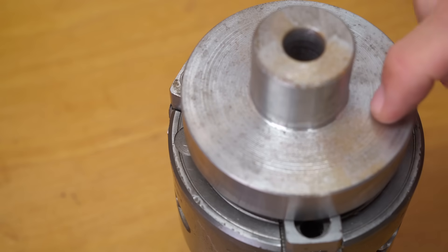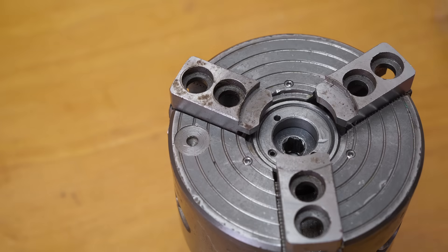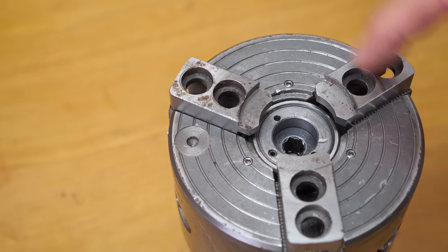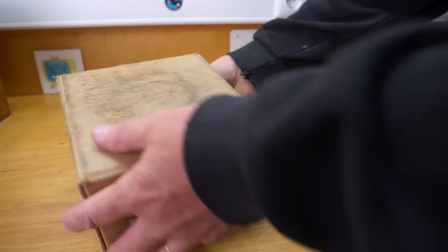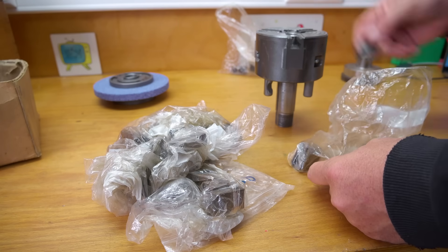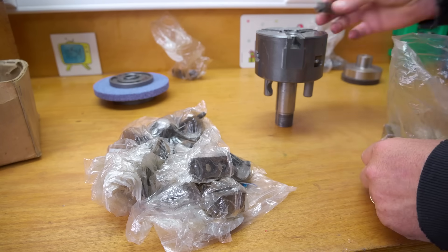These wheel hubs are probably a hundred millimeter diameter, so I'm going to need to grip sort of out around the second hole of the bolt pattern here. So I'll try and find a set of jaws that are already as close as possible to that diameter. Let's go through these soft jaws and find one set that's already roughly at the diameter we need.